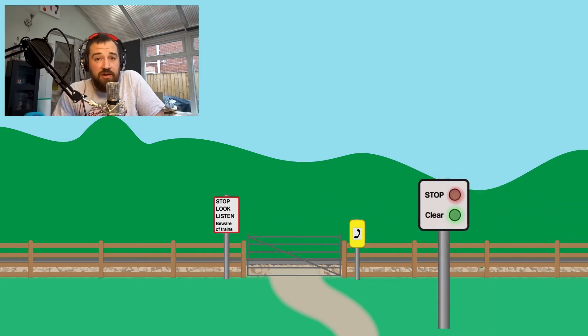All of these options work quite well on these lower-use tracks and trails, but what if we wanted to scale things up to a real road? Well then the safest option is what's called a grade-separated crossing, where the road and the railway cross each other at different levels — so a bridge, a tunnel, or an underbridge. Very simple, but much more expensive and they take up a lot of room, and especially in urban areas there are just times when that is not an option.